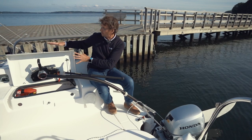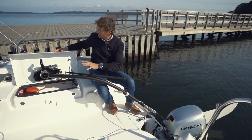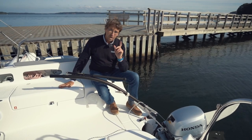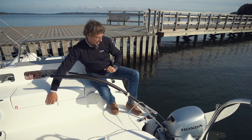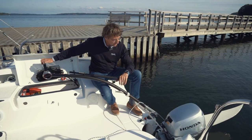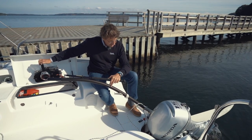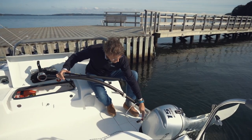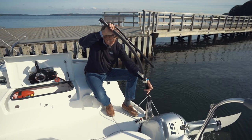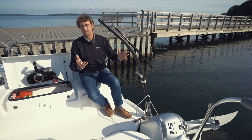One important detail: when motoring, either keep the rudder blade fully down or fully up. If you take the rudder blade halfway up and turn, the rudder blade can get caught by the propeller. If going into shallow waters, just pull the rudder up and maneuver the boat like a powerboat — you can still turn. When you go sailing again, close the tiller link down. As a convenience feature, when in the marina you can just lift up the engine and leave the tiller support on.